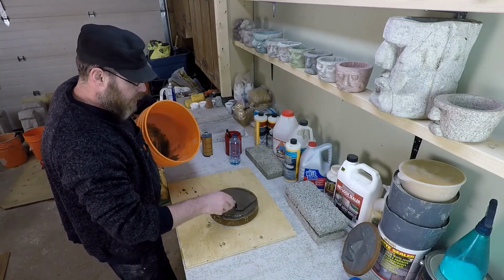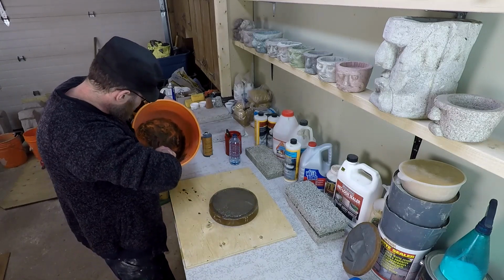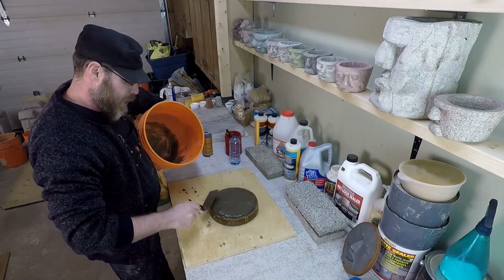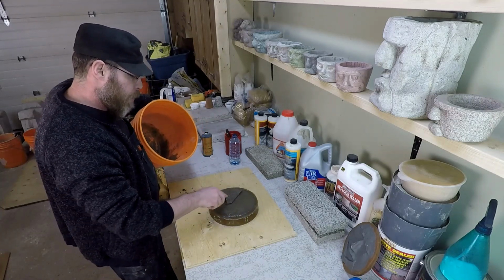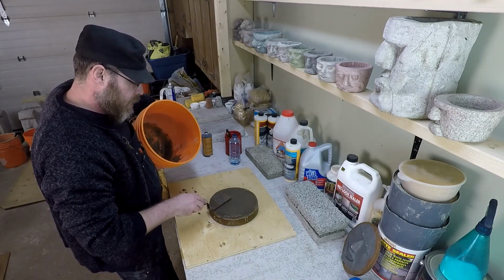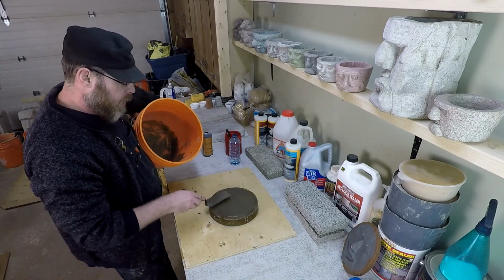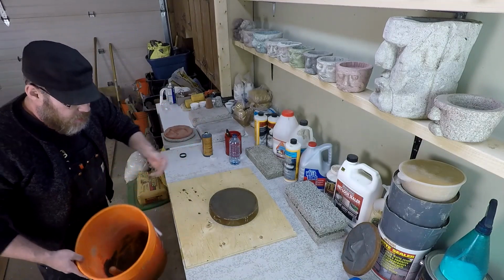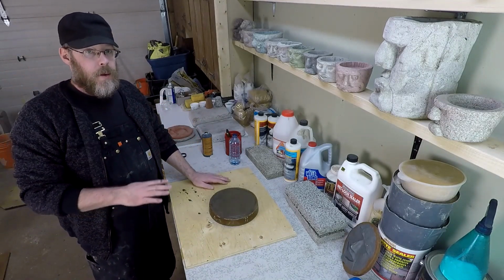It's definitely darker. I mean, I work with mortar and concrete often, and I can tell that it's much darker than normal. Is it black? No, I wouldn't say so. But you're gonna be hard pressed to get jet black concrete. I think this is what you'll get, something that's gray, dark gray, charcoal, but you'll also get a lot of inconsistency with the coloration. And if I made 10 of these on 10 different days and compared them, they're all going to be different.